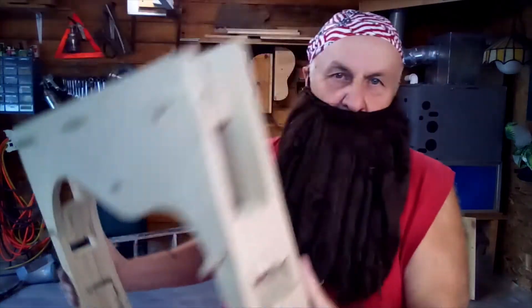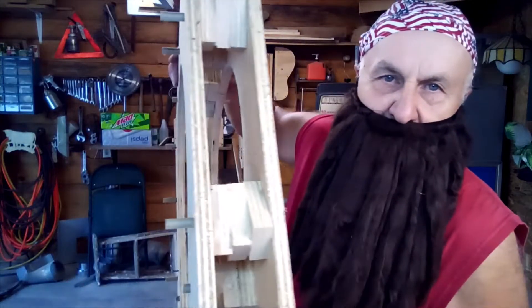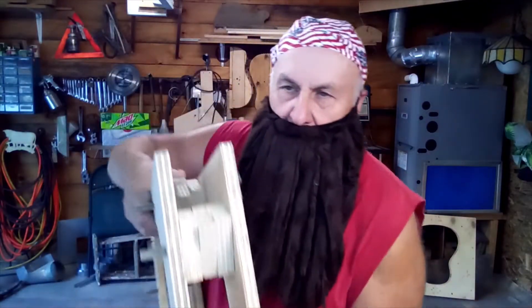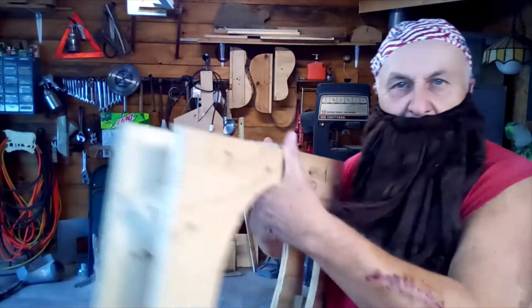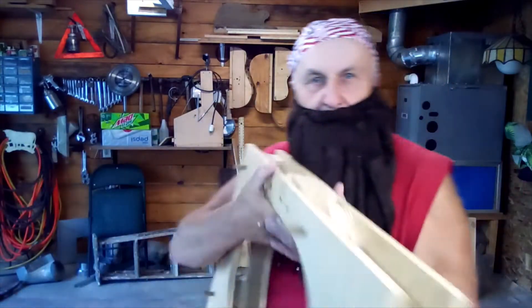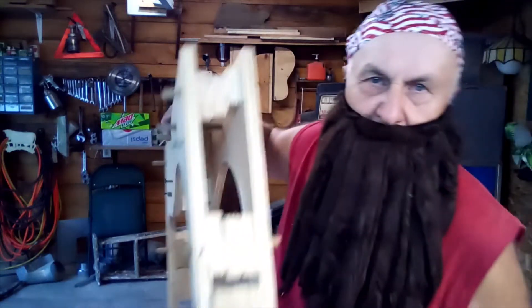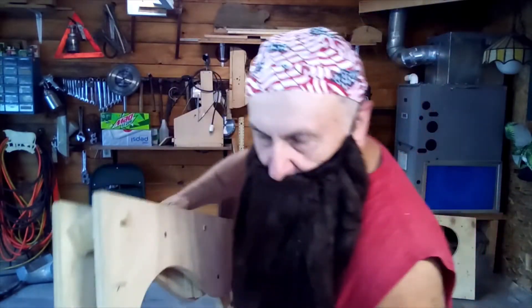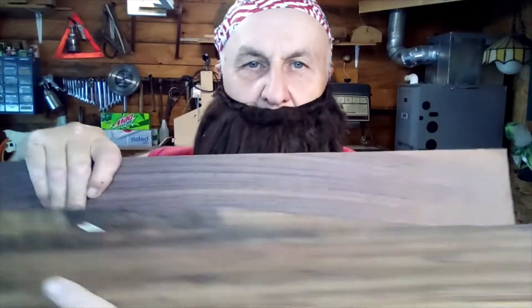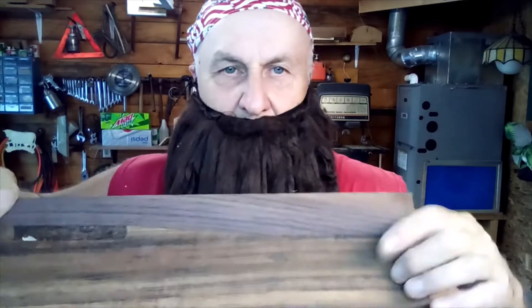This is a D28 copy body. What I done on these is lighten them up — I used plywood, cut them out and shaped them, clamped them and drilled the holes so they'd be perfectly lined up, put dowel pins in them, fastened them on one end and one side, glued them in. Then if I had a wider body or a smaller body I'd put these shims in it to raise it up or lower it to make a different size body. Here's one I made out of tiger wood — you can see how little it is — and this would have been a rosewood one; you can see the difference in them. This was made for a smaller person; this was made for a full-size guitar. Worked out pretty decent.